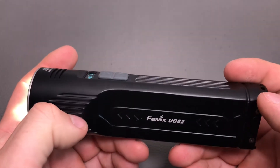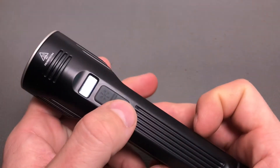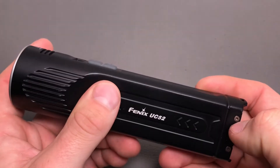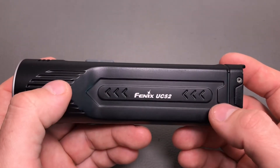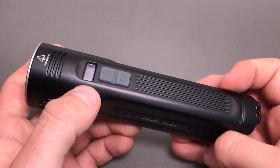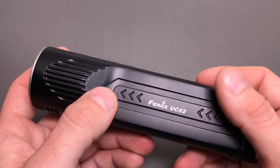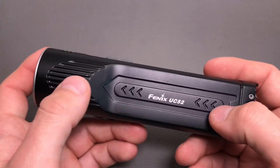The flashlight has an overheat protection built in — it will turn down the light by 15% after it reaches 65 degrees Celsius. In my German review I already tested this, and I'll show you the light on the Ulbricht ball afterwards. The light keeps full power for six minutes, then it gets so hot you can't hold it without gloves. After six minutes the light intensity drops to about 1700 lumens, which it will then maintain for a very long time as it won't overheat as fast in that mode.